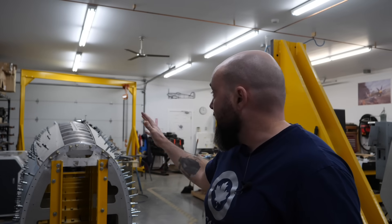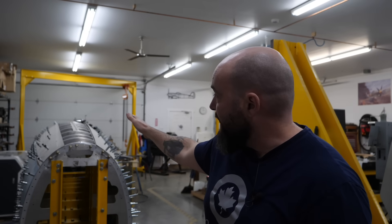So when you go to fit these skins and you have flat sheets that have the primary curve on them and you suck them down to the frame, you end up with the outside edges of the skin being too long, which gives you a bit of a wave. To alleviate this, rather than building a massive fixture to pull the skins in the center, we shrunk the skins on the outside edge. So the center is still that much longer than the outside edges, and it wrapped around and basically hugged the shape and profile of the fuselage. It worked beautifully, and as you can see there is a bit of a compound curve — it's quite a beautiful structure.